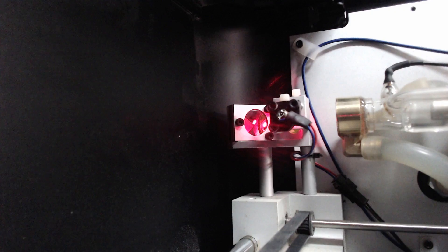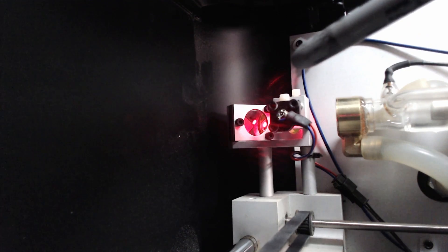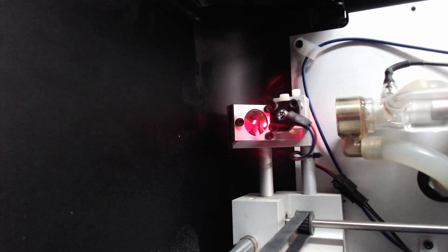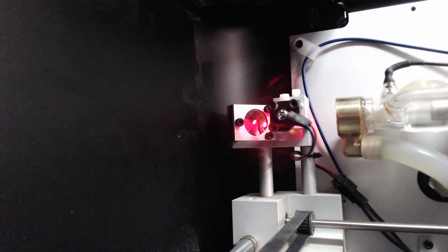The laser beam is coming out of the laser at whatever angle it's coming out at, and all we really care about is that it's hitting that mirror - it doesn't have to be in the center. The way the machine is designed mechanically, it comes out very close to that center anyway, so there's not much we can do there. We'll start at mirror two.